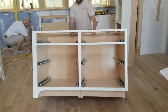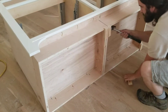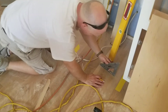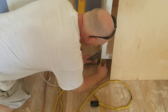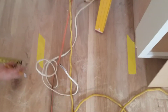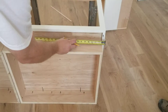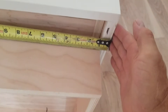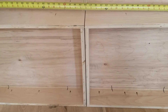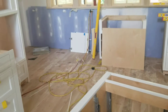Trey is going to put this on its back so we can look at the bottom of the cabinet and determine exactly where the vent is going to be. Trey is removing the cleats. David's going to transfer the marks — that's the start of the dishwasher — lines it up, marks 24 inches, so that's the end of the dishwasher. He's measured over from the marks he put on the floor — 20 to 34 — and that lands us right in the middle of the toe kick. We'll just have to bust these two out and cut two holes so that boot can sit right on top.